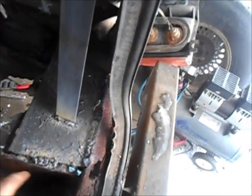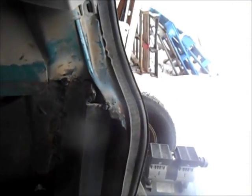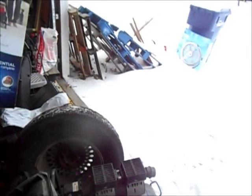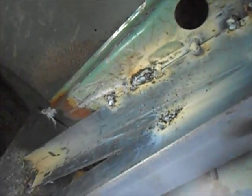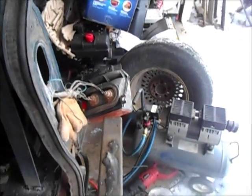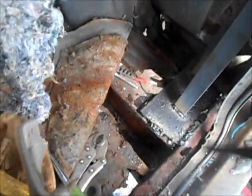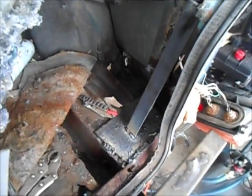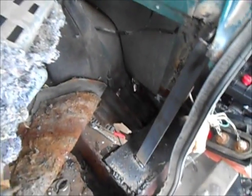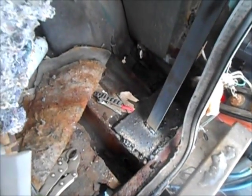This was the one that was shaking up and down. I just welded some 3/16 steel in there and then a couple pieces of angle iron. Tack welded it up — a pretty rough welding job, but I can put my weight on it and it's not moving. I've got to jack up the axle now and see if I hear any creaking or groaning when I put the weight back on it. Well, I can't do that yet — I've got to put the other leaf spring in first.